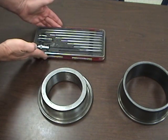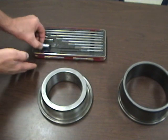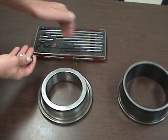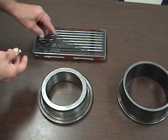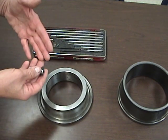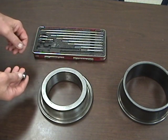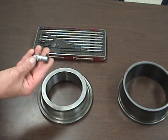There are several inside mics. We're going to be using the Starrett interchangeable rod type. This is the anvil. These are the rods. The other type that we've seen in our other videos is the inside micrometer one-jaw type, which reads backwards. This reads like a standard mic.